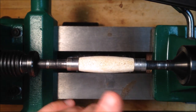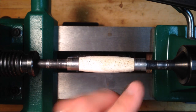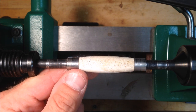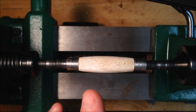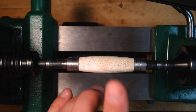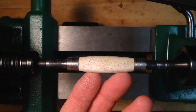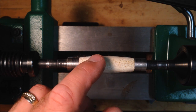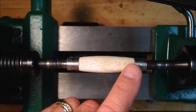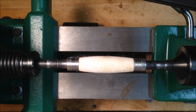The first thing that I did with this blank — now my lathe is not reversible — so I took the blank off the mandrel and flipped it around so that it would be spinning in the opposite direction from which it was turned. I'm going to sand this blank through 400 grit. After I sand with 100 grit, I'm going to flip the blank over, sand with 200, flip it over, sand with 300, flip it over, sand with 400. That way I'm sanding in both directions as I switch between the grits, and that's going to help me more evenly take down some of the rough spots on the blank where it's very porous. With my lathe set to the lowest possible speed, I'm ready to start sanding.